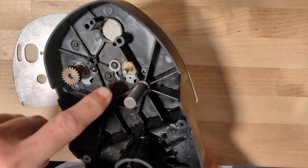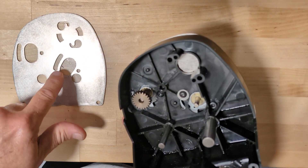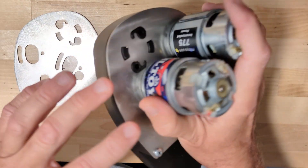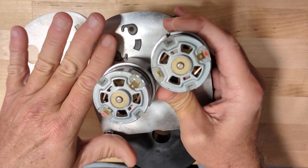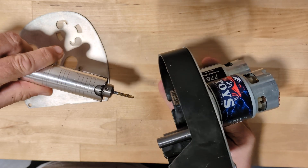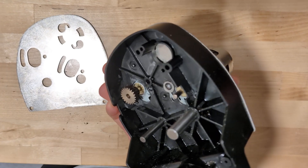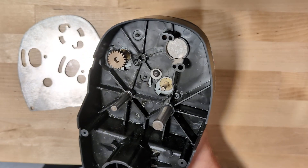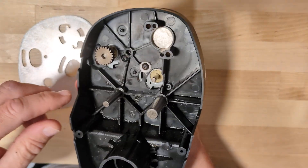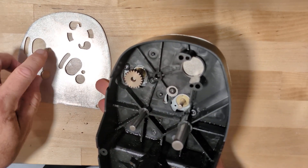Then what you're going to need to do is carve out the holes for the motor screws, for the center of the motor, and for the slide. When you have the motor mount bolted in place, it's going to become a template for you to carve out — it's really easy to do. We use the Dremel carving tool. They make a lot of different carving bits. This is really soft plastic and it's very easy to carve up with a variety of tools. If you're using a Dremel, use a high RPM — you're really almost more melting than cutting as you follow the lines along the template to get the motors mounted in place.